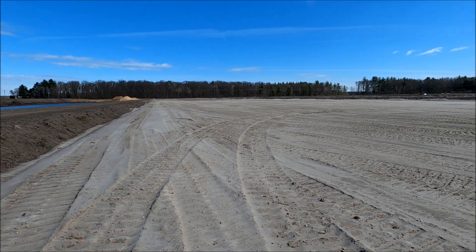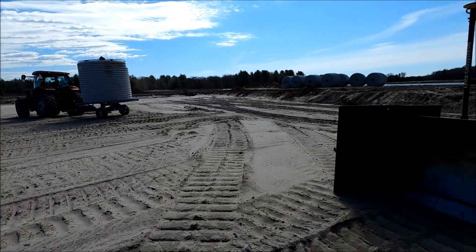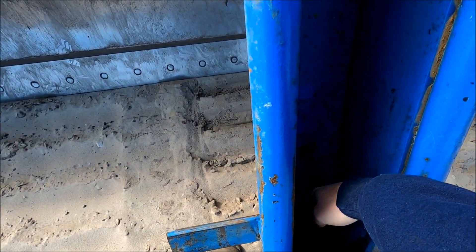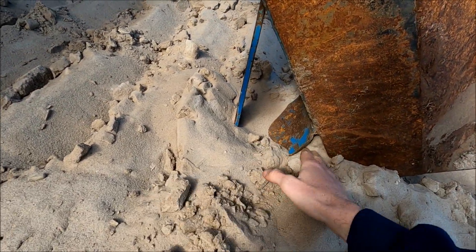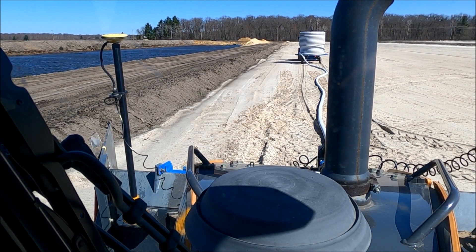Here is a bed that is fully rough graded — it's ready for tile. The drain tile will go down here, running in the ground about 12 inches, and the drain tile comes out the bottom right here. The tile plow is set and we're ready to go.